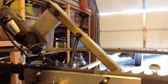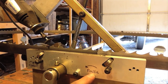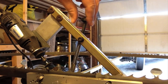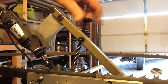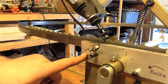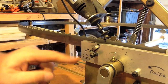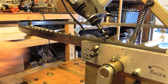Another adjustment we have is this top knob up here, which adjusts the height. Down below there's an arrow pointing left that says 'raise' — because if we turn it counterclockwise, it'll raise the grinding stone. You can see it going up, and turning it the other way lowers it back down. Now, behind the blade we have this knob here. If you turn it clockwise it gets closer, meaning the grinding stone gets closer to the front of the tooth. You can see it moves this arm, which is what pushes the tooth into the grinding stone.